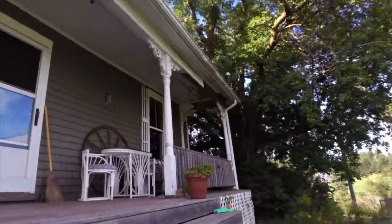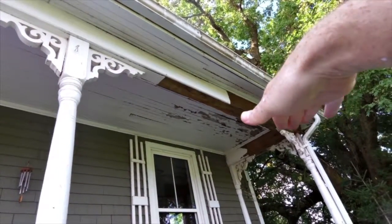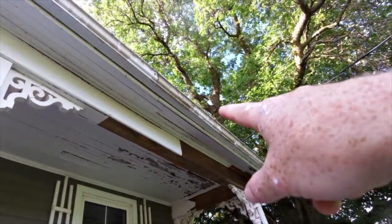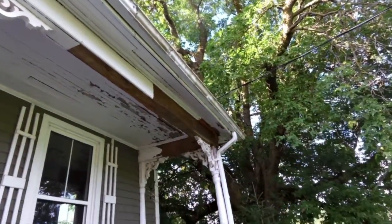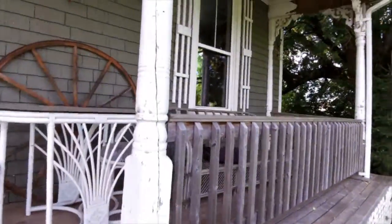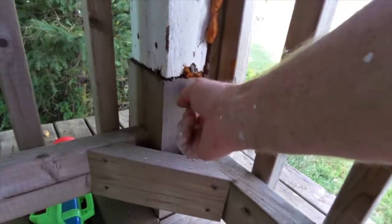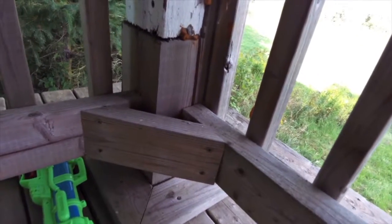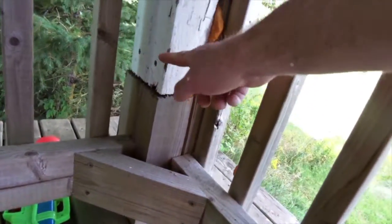The final part, which I haven't even touched yet, is the front porch - a project we did when we first purchased the house. This porch actually had a hole in the roof which was fixed when they put the new shingles on, but this whole part of the roof was down so I had to lift it. All that was rotten wood up there, so I replaced it - the dark wood is the stuff I replaced. The poles were rotten at the bottom too; I got my chainsaw and cut all the dry rot stuff off, then put new pressure-treated 6x6 down to the island stone base footing. I just have it screwed in here and it's stayed there for a couple of years.